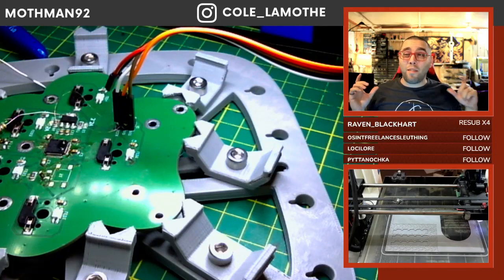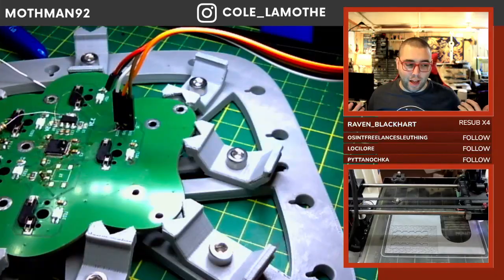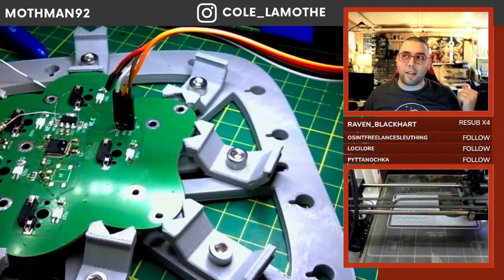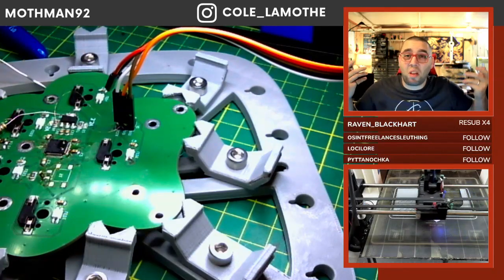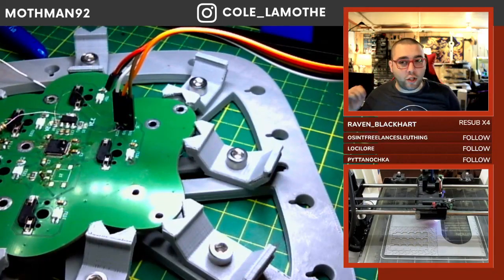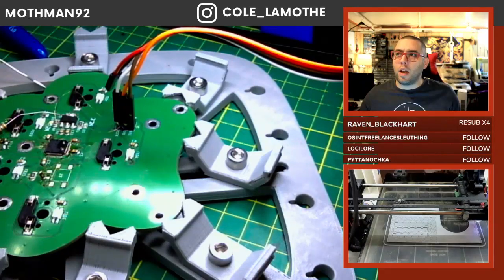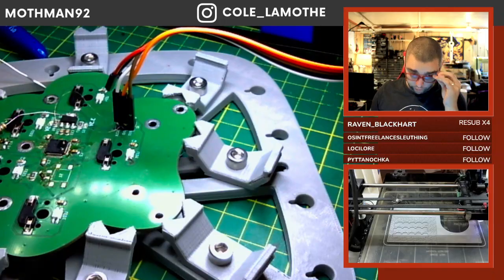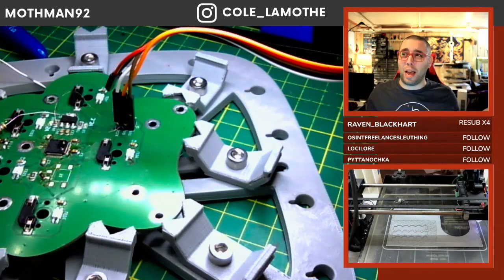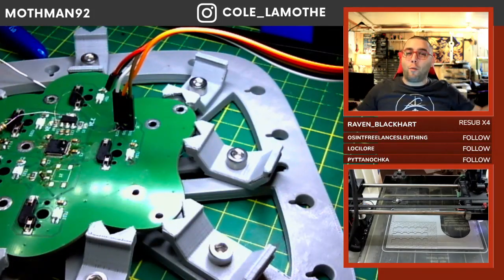Laser cutters — you have basically the design files right there. It's a DXF or SVG or something of that nature, which is already in itself editable. So if there's something that has what you want that's kind of close, make it happen. Laser is awesome in that way, because it's harder to do that with 3D printing files. Usually you get STLs, which are kind of like a picture of the outside of the model, and you have no other information — it's an approximation, a triangular net wrapped around that object.